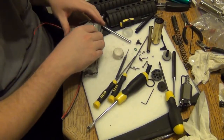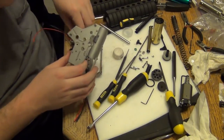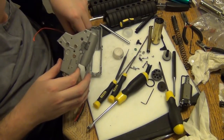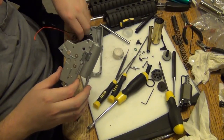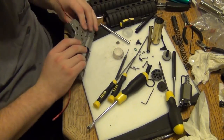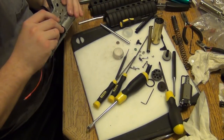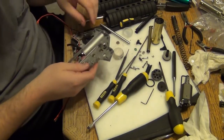And the most, let's say, exciting part, maybe, because I'm being sarcastic, is shimming all the gears together. Once you get one, you work on the next, and you watch each gear to see how they move. And when you get towards the end, you put your hand in the gearbox. Only put the gears together, guys. Only the gears and the shims with the bushings.